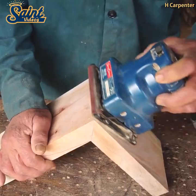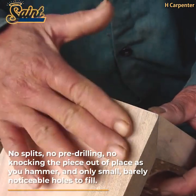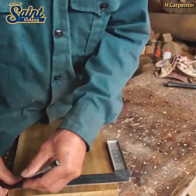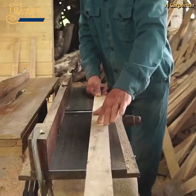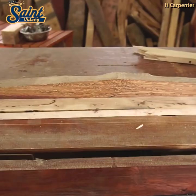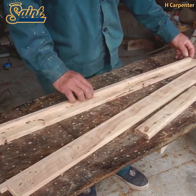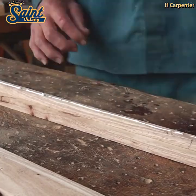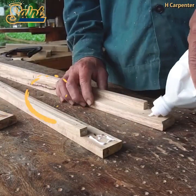The bench does double duty as a super convenient work surface too. I haven't hand-nailed a piece of interior trim in 25 years — because air-powered trim guns make the results so much faster, better, and neater. No splitting, no pre-drilling, no knocking the piece out of place as you hammer, and only itty-bitty holes to fill. If you are going to buy just one size, the most versatile choice is one that shoots 5/8 to 2-inch 18-gauge brads.